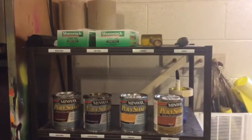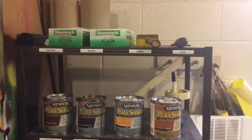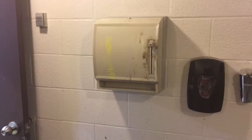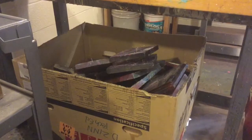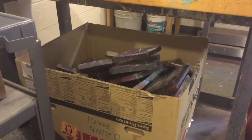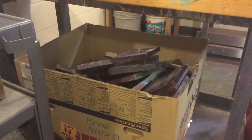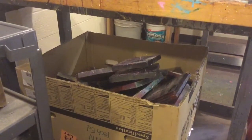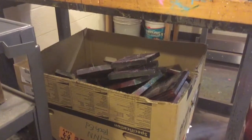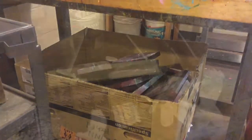A couple of last things: on the very top you're going to need a screwdriver and a hammer, and on the right-hand side grab a few paper towels just to help with cleanup. Underneath the table you'll see a bunch of boards with nails inside a box — you'll need at least one, maybe two, if your project doesn't fit on one. These help suspend your project above the table surface so nothing like dirt or debris gets stuck on your finish.